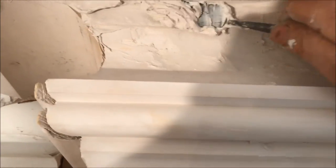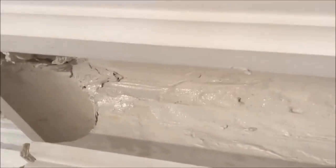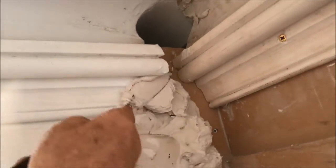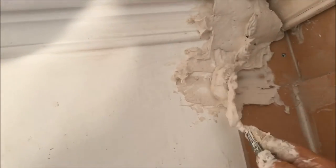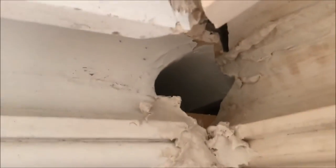I'm going to shave that up a bit. Starting to take up a little bit of the corner cement. Float the ceiling out too. Give it a brush over with some water. Shape it up — this 40-grit tape helps get a basic shape quickly. We've got some pretty big holes here, a little bit of carving to do.